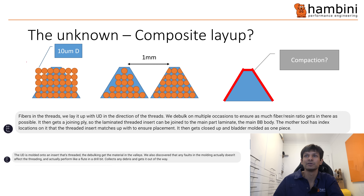The blue stuff represents the resin and the orange bits are the fibers — not to scale. These orange fibers are typically 10 microns or 0.01 millimeters, and the thread pitch on T47 is 1 millimeter. So you would typically be able to get about a hundred of the fibers in between in the gap.